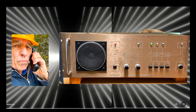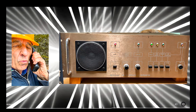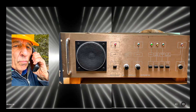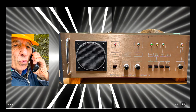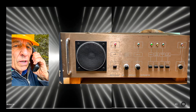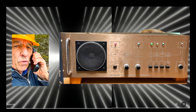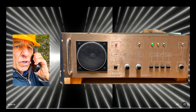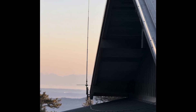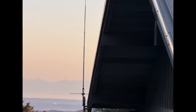Another great thing about GMRS is your ability to use repeaters. A repeater is just what it sounds like — it's going to pick up your signal and rebroadcast it. Whereas your little handheld might be broadcasting at 5 watts, when the repeater picks it up, it's going to rebroadcast it at 50 watts. So whereas your handheld might go a mile or two, maybe four or five miles, your repeater will often be able to get it out 20, 30, even 40 miles, depending on its location. Get the repeater up on a nice high mountain with a really good antenna, and it can definitely reach 20 to 30 miles. Your repeater location is chosen specifically for its ability to get the widest possible distribution for the signal.